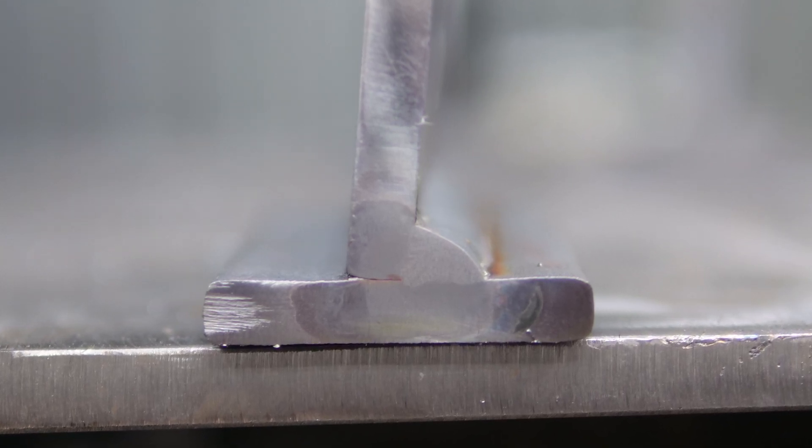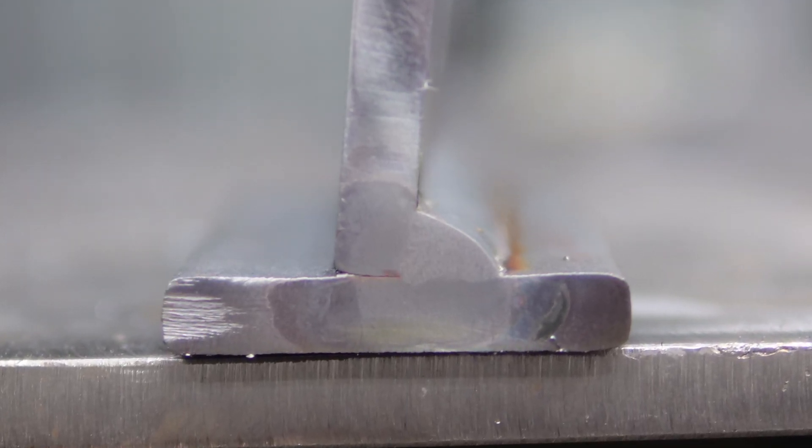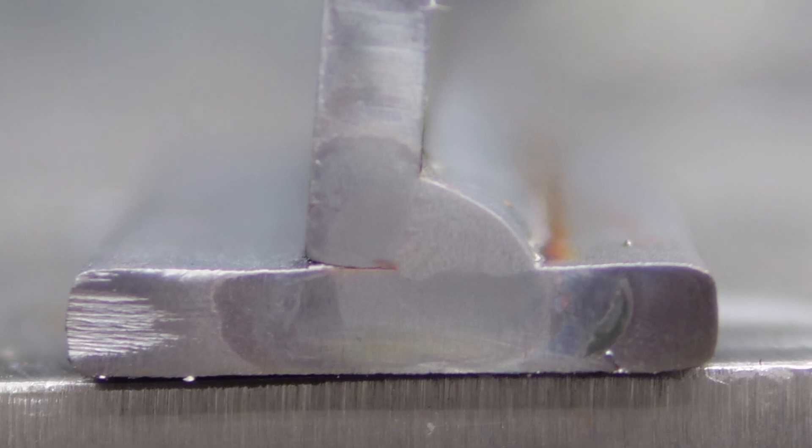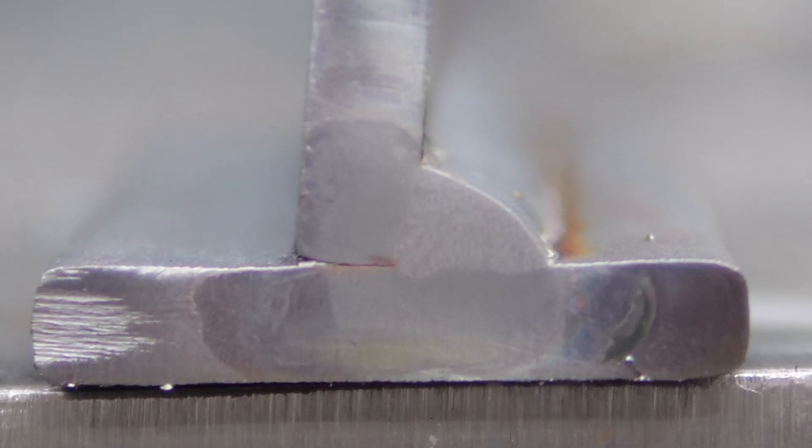Here is the L56 on some quarter inch plate. The difference here, as opposed to that eighth inch plate, is that this is hot rolled steel, so no cleaning involved — we just welded right over the mill scale, trying to see how the two wires would handle the scale. The L56, as I would expect, handles mill scale just fine. The face of the weld is slightly convex and the toes are in good order. Looking at the cross sectional area, it's got good fusion at the root of the weld. This is a partial joint penetration weld, so we only need penetration right where the two pieces meet, and it does that fine. Typical solid wire — a little more penetration towards the root, and then it bows in towards the edges.